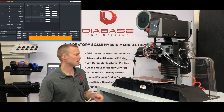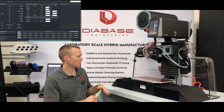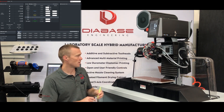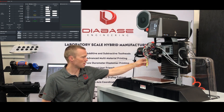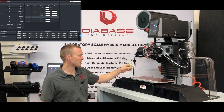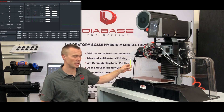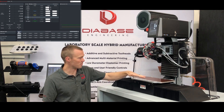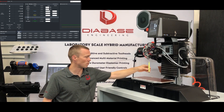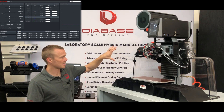When you're working with a CNC machine it's always helpful to think of the motion from the perspective of the tool. The bed moved to the back right corner of its travel on its end stops, but thinking from the perspective of the tool, the tool moved to the bottom left corner of the build volume — the most negative in X and Y. Then the bed moved back to the center, so the tool moved positive in X and Y to the center of its travel.